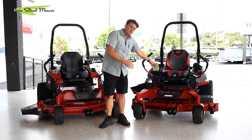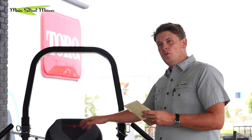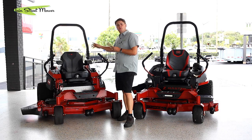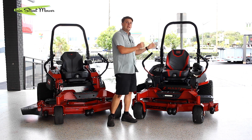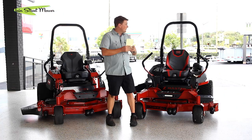Let's go over some of the 4000 series differences — I'm calling these the cons of the 2000 series, but really it's the differences between them to see if that $2,500 in value is there. With the 4000 series, you get a hydro reservoir — I'm able to see how much hydro fluid is in my hydraulics and change it easier. That is a feature I really appreciate that is not on the 2000 series, so it's slightly harder to service the hydraulic system, which means a little more labor and potentially more expensive hydraulic changes. There are no arm rests on the 2000 versus arm rests on the 4000.